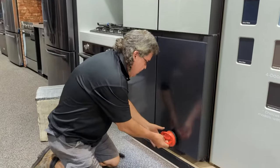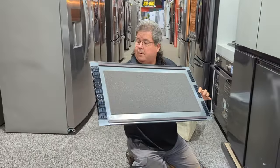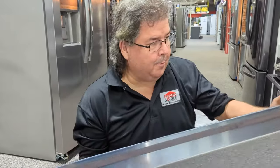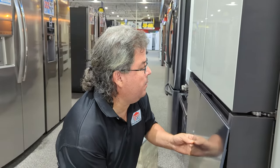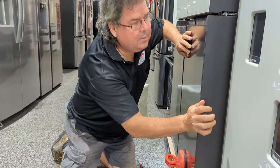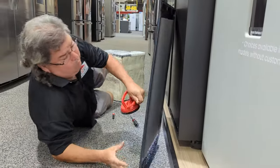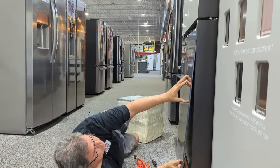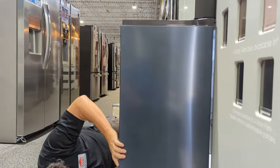What we're going to do is put the zinc back here on the bottom, clip it in, pull, and drop — just like that. See? Real easy, real basic. There are even magnets to help hold it in place. Then put the new one back in, line it back up — it's easier said than done sometimes. Give it a little pop, make sure you're back in place, and then put this back up in here. Unfortunately this one is broken, but we're still going to throw it in — then you'll pop it right back in place, and you're good to go.